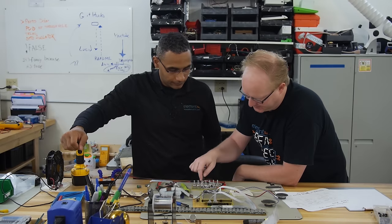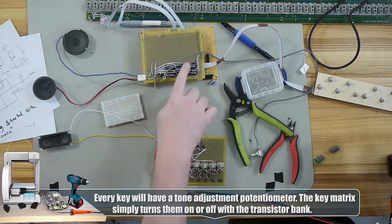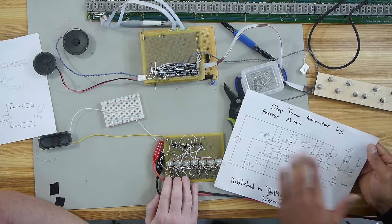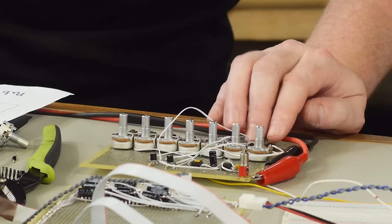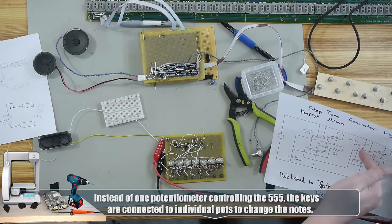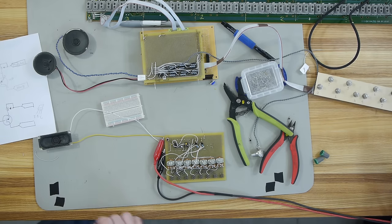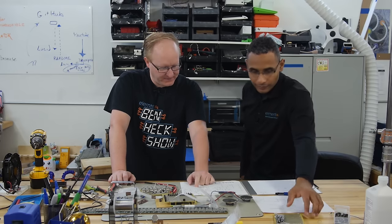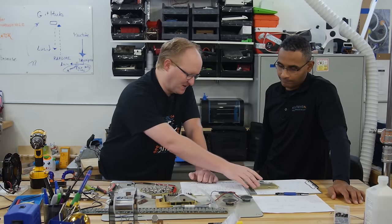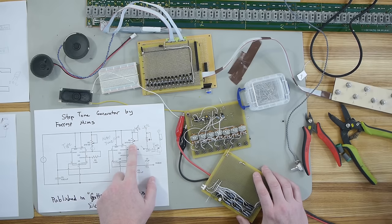Felix, I guess the next question is how do we rework this to replace this board? We can probably do it with a lot less circuitry. The same signals that are coming off of this could easily go to this. But the question is, how is this wired exactly? You have multiple inputs going into the 555 — you have them in parallel? So you basically have a bunch of parallel potentiometers, like one after the other. Can you draw that out, and then we can figure out the best way to proceed? Just draw out a couple of them so I get the idea, because we may have to approach this differently. So we need to switch this around — we already have the potentiometers hooked up to these transistors, so we're getting different amounts of voltage here. We basically have to rebuild this, but we can make it much simpler.